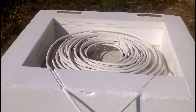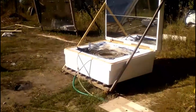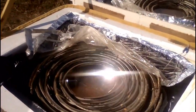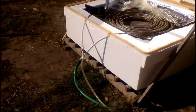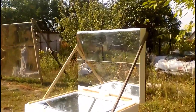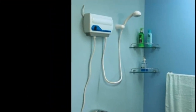These 40 meters of metal-plastic pipe will be surrounded by those 100 liters of water, and this greenhouse is connected to the cold water pipe of my summer cottage. Those 100 liters heat the cold water when it goes through this pipe, and then hot water moves through this hose to this water basin mixer and to this shower. I explained all this in more detail in one of my old videos, including the collaboration capabilities of my solar hot water system with a tank electric water heater or similar tankless electric heaters.